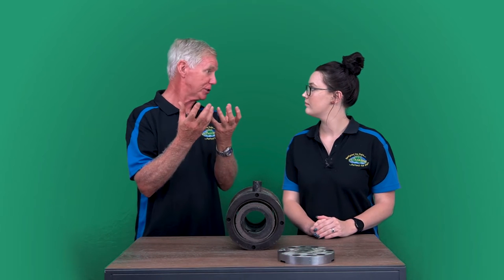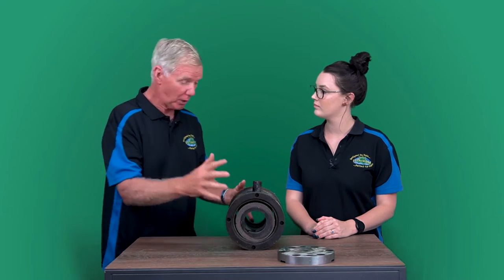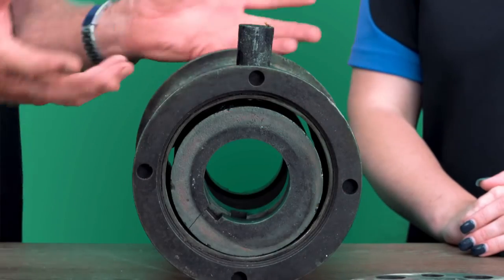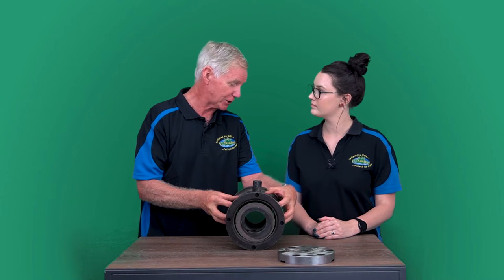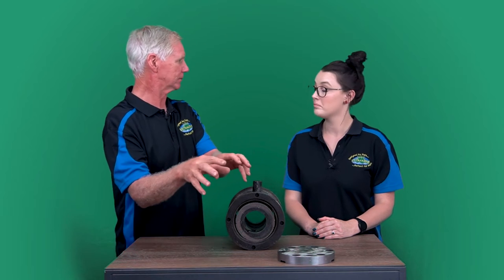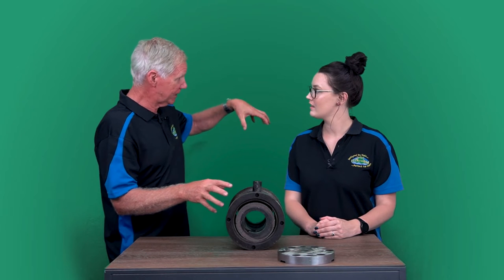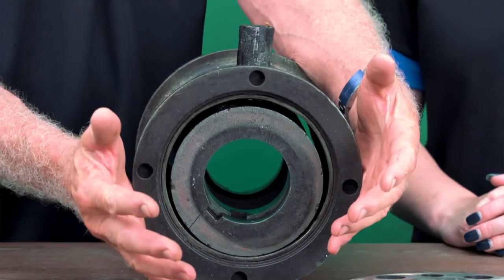The temperature rises really quickly — mechanically it's sheared apart. Also at the same time within these chambers is a huge pressure increase. So you can think of the extruder as a continuous pressure cooker — stuff comes in this end, gets passed along the chamber, temperature goes up, pressure goes up, shearing occurs. The cooking process is happening within here.